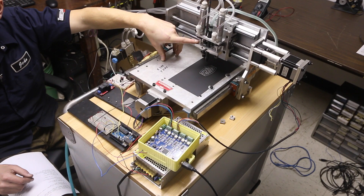What I need to work on — and I'd love your input — is controlling the precise depth of the engraving. My thought was that with pneumatic cylinders you could basically overdrive it and the pneumatics would absorb some of that by staying higher, but that's not true. It's literally trying to engrave too deep, which actually speaks to the strength and quality of the engraving tool.